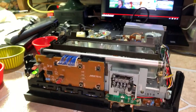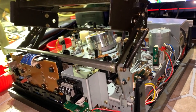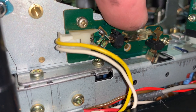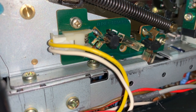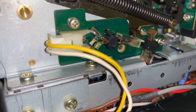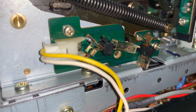I had to stop recording because I put the test jig in and nothing happened. I can't multitask so that's why I stopped. It was a real simple problem — I ended up checking all my connections first. There's a micro switch right below my finger. It was bent down by 45 degrees, so it was still open. Whenever you put the tape in, watch — it makes contact, closes the contacts, and it knows there's a tape in the machine. While it was bent down so far it still didn't see the tape and wouldn't let it operate. It must have happened when I was moving things around, flipping it over to change the belt. But that fixed it.